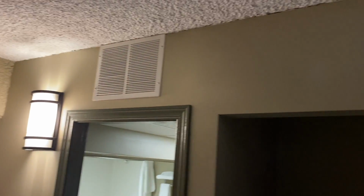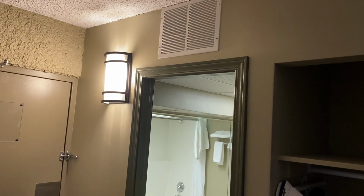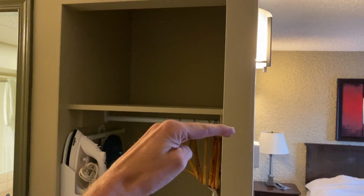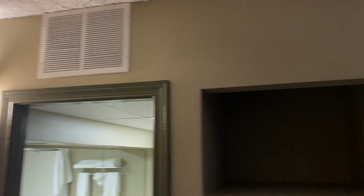And the only thing to note on this wall is we got a classic crack right there. So basically somebody probably boarded the top of this as one piece and then did the legs of this as separate pieces. So usually what I'll do is I'll take a full sheet. I'll go from that corner over there to that corner and it'll run down to wherever 4 feet ends. And that way you don't end up with separate pieces right here and right here. It goes all the way down so that this doesn't crack as easily. That's why we do it. It's called picture framing. It helps reduce the cracks.